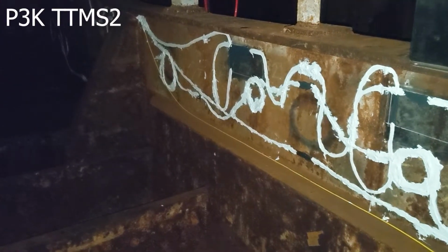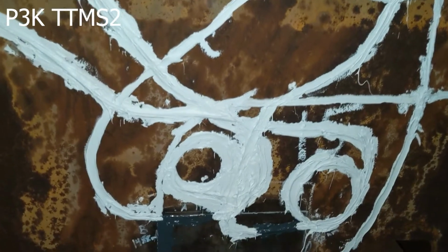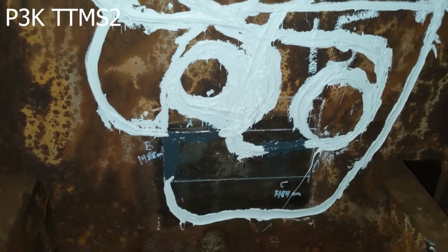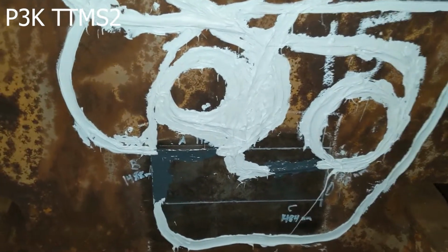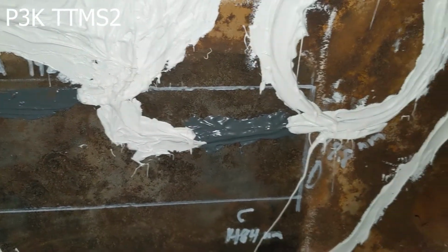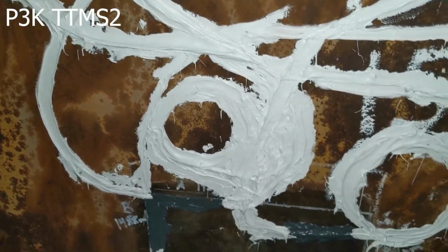This is web frame K in Pontoon 3. And here are all of the sensors. I'm going to walk through each one, just talk about each sensor station a bit. We have sensor station, this is number 15. Right here you can see we did the standard fibers, but we did not do any of the C and D, the plate sensors. You can see the standard fibers on this side, and then you have a ceramic temperature gauge right there on that same pad. That's the lower right temperature gauge.